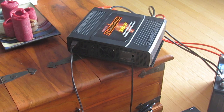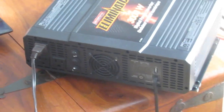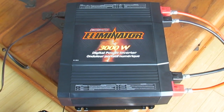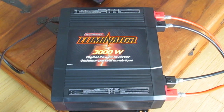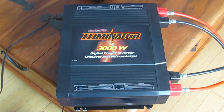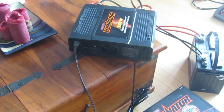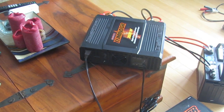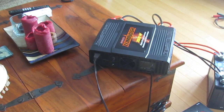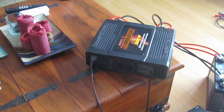On the back there were some fans, and there's also a fan on the front. This is potentially one reason why you don't want to get this big an inverter if all you plan to do is have one battery for emergency purposes to power a few low-draw appliances. You can probably get away with a 1000 watt inverter, which wouldn't draw as much power to run fans. There are three fans on this one, and they don't typically come on if you're only running a light. Probably at around 1500 watts they would start to come on.